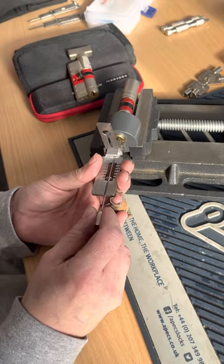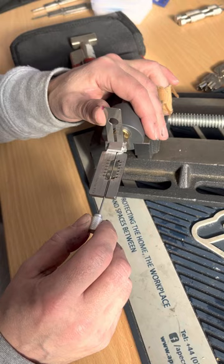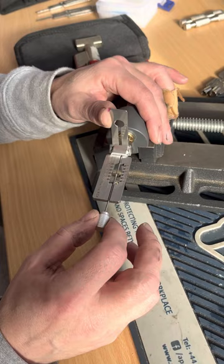Light tension, and I'm just going to test each pin. Pin one is bouncing away — lovely. Now two — this is definitely a zero lift pin. As I go over the top of two, you can see it's already pushing my pick tip but it's got a bit of spring to it, so I know I'm leaving that alone. Not touching that. Go to three — three is our first binder. No spring to it, it's dead.